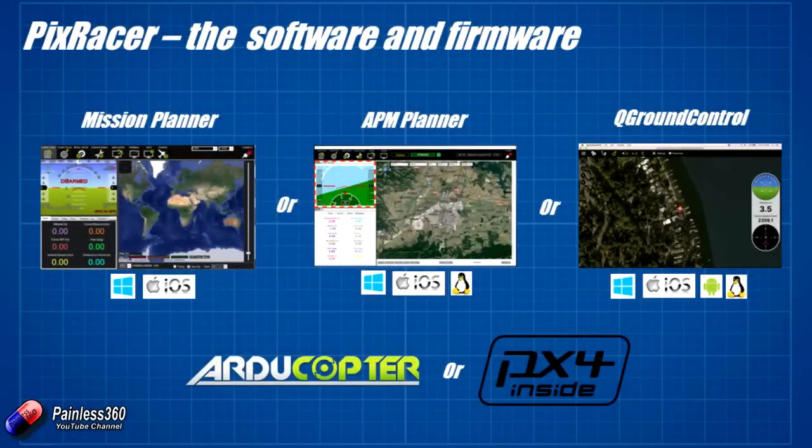There is a lot of choice now for ground station software that will both configure the board and flash the firmware. We're looking at three here, but this is by no means a definitive list. Mission Planner on the left hand side is the one we've used in pretty much every video on the channel — we've used it to flash APM 2.5, 2.6 boards, APM 3.1, Pixhawks — and it has been fantastic, a really robust platform supported heavily by 3DR, and it works great even on slower netbooks.